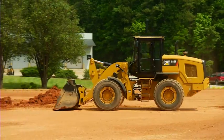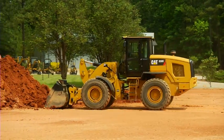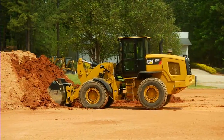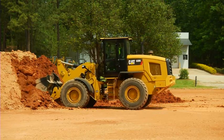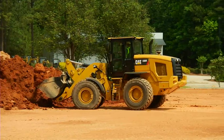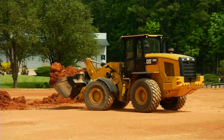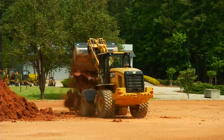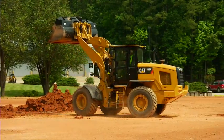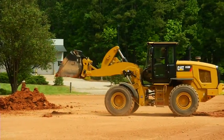Back into the pile as I approach. Now at the back of the V, I'll use my left pedal to slow my ground speed, make my directional shift, and approach the truck with high RPM for good cycle speeds. Adjust down to zero with my left pedal control, and I'm set for the next pass.